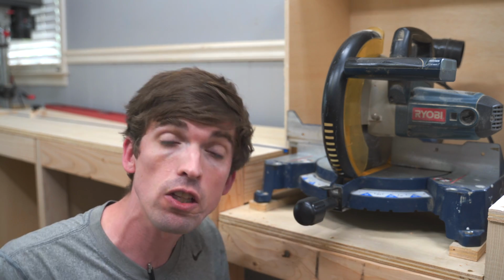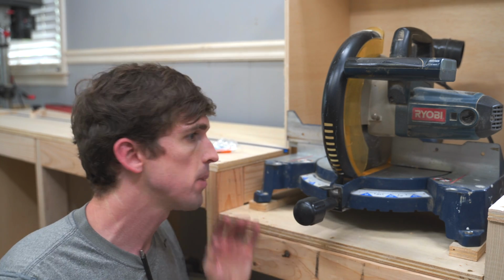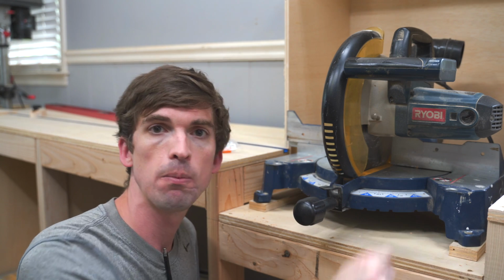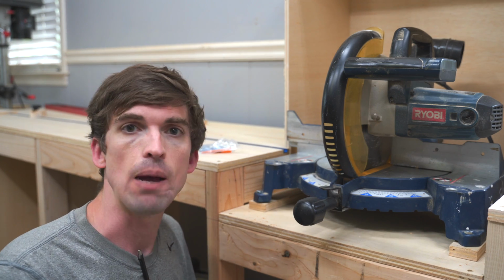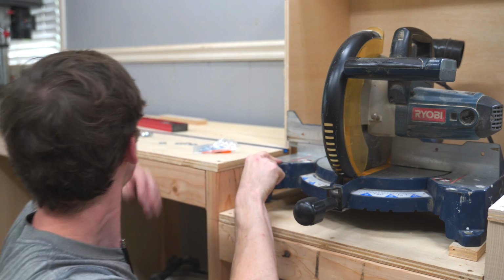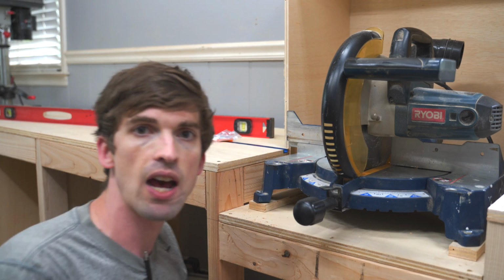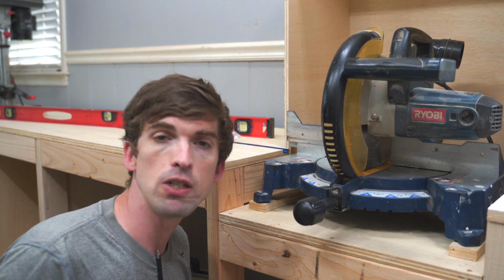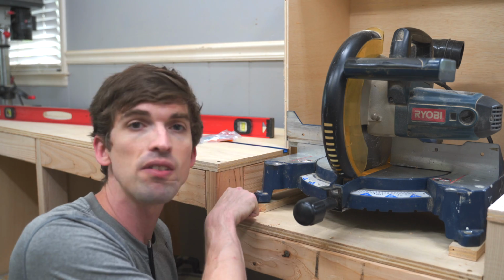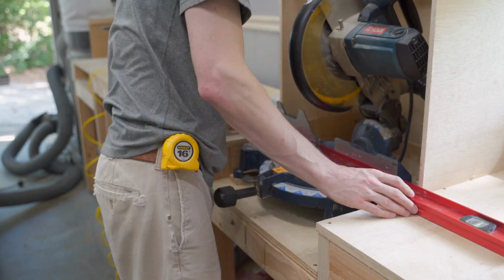All right, so this is starting to look a little bit different, kind of like my face. And we're attaching this permanently, or permanent-ish, to the miter station. I'm just using some 1/4-inch bolts. And then I'm gonna use washers to dial in the actual distance. You can tell right now that we're just a little bit off. To fix that, I've got several washers that I'm gonna be dropping underneath right here just to lift the whole thing up. All right, so I'm gonna get one side, make sure I get the spacing right, and then I can do the same to everything else and knock this out.